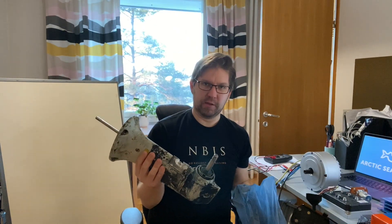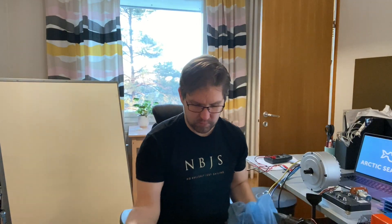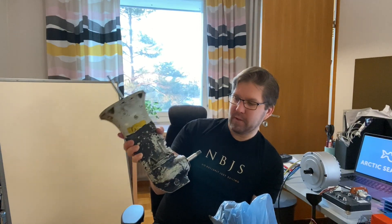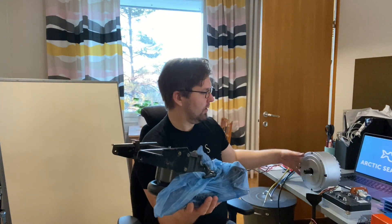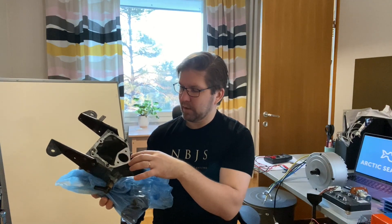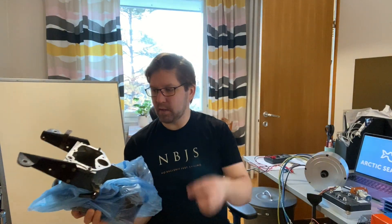So what I need to do mechanically: first, make sure nothing leaks — there's an old cooling water intake I have to deal with. The sail drive has a forward/reverse gear inside but it's already disabled, so it's permanently going forward; I don't need the gear switch. I also have to make sure the hole for the handle doesn't leak. Then I need to somehow mount the motor and couple it with this sail drive. We need a middle plate that connects to the sail drive and to the motor, plus a coupler between the motor axle and the sail drive axle. That's the mechanical part and I'll make another video for that.